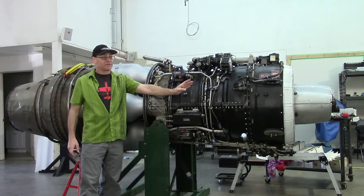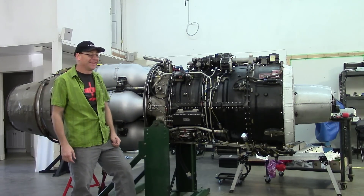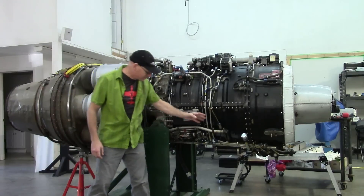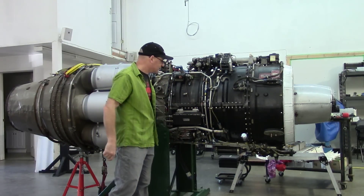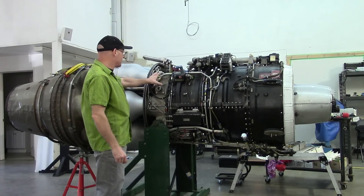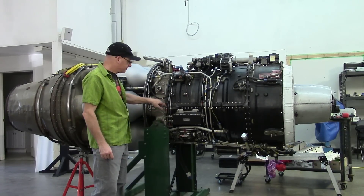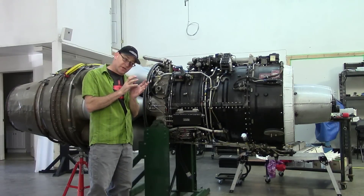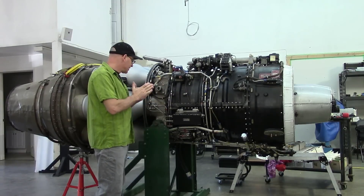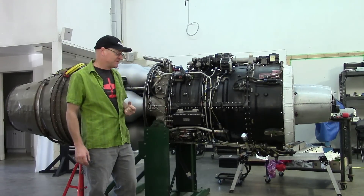This engine showed up after a certain number of years of storage and was apparently flight-worthy, with lots of hours left in the logbook. What we found when we started it is we had a rainstorm of fuel — lots of leaks. So what I've been doing for the past five days is replacing every O-ring in the fuel system. There's a tubing connection between the fuel line and the fuel nozzle, but it goes into what's called an ORB fitting, which has an O-ring compressed between a threaded piece and a flat piece. The O-rings were all crumbly and rotten and leaky, so we're replacing all of them.